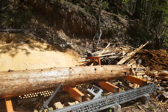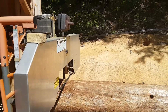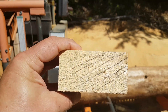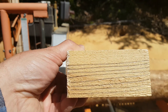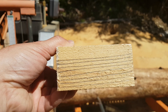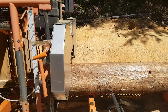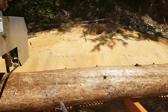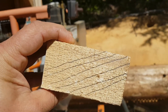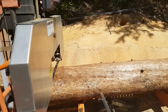Not a great amount, but we've got about 4 inches difference from one end of that log to the other. Somebody starting out in this business might say, well, what's the difference — why do I have to adjust for taper? So if you look at this block of wood here, now I've kind of exaggerated this. When you saw a piece of lumber you want the grain running straight through, like those pencil lines on that side of the piece. You want a nice straight grain running through your wood — that makes the wood structurally sound and something that's a pleasure to work with. If I sawed that log just the way that the taper is running, I would wind up with grain running on an angle. The grain pattern running through that lumber wouldn't be structurally sound. The wood would have a tendency to split on you.